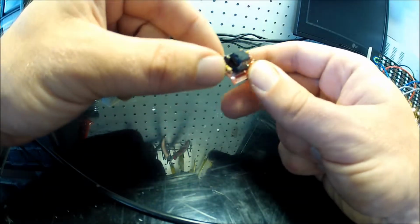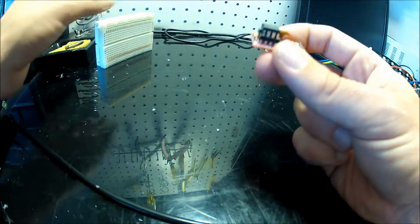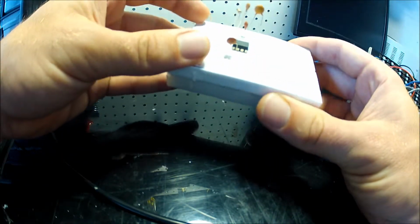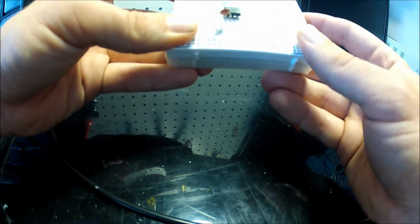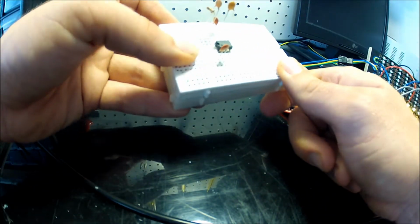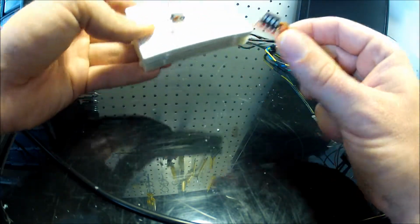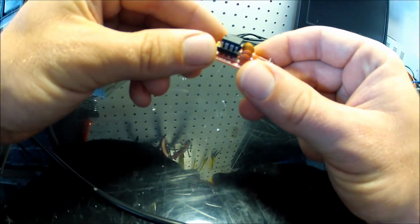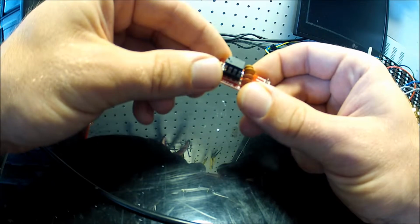The reason we've elected to go with through-hole technology and dip packaging for the integrated circuit is because these chips have a reputation of having relatively poor quality control and relatively spotty supplier reliability. We wanted to ensure that every package that we shipped had the capability of being easily tested and replaced if it was not functioning. By using the dip socket, we're able to replace faulty chips with ones that are known to work. Additionally, this technology allows us to individually test every single breakout board in an actual audio responsive product.